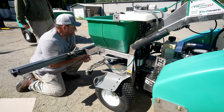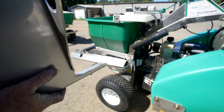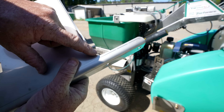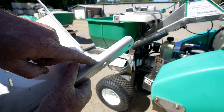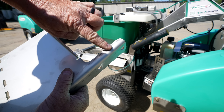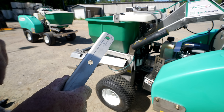Go ahead and run yours in on your side first. Something else I had to do — if you run the boom and the fill system at the same time, I have to come right here on this lip and cut straight out and cut straight down, because the boom mount comes in contact with this. I just need to cut that little piece of steel out so that I only have a flat plate on that side.